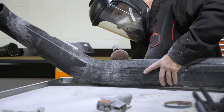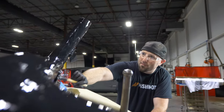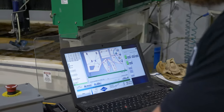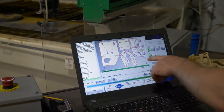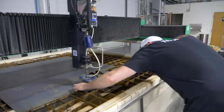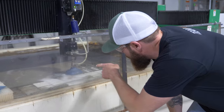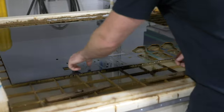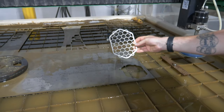It's a two-part epoxy specially designed for 3D printed parts. These are the mounting brackets for the Jeep JL snorkel kit — you can see we have six brackets. We'll cut these out on the water jet, then go over to the press and bend them, and once they come out of the press some of these will get welded together.